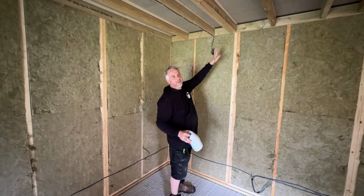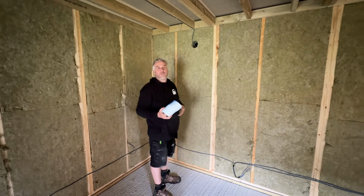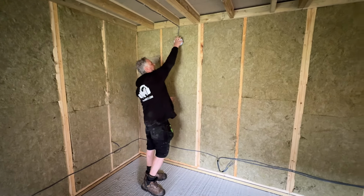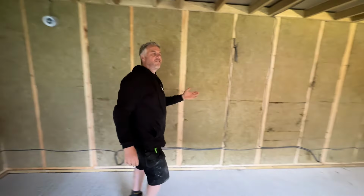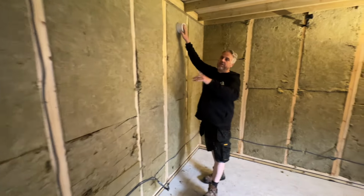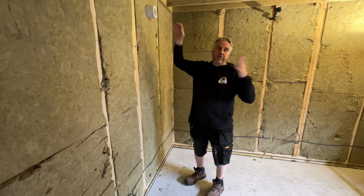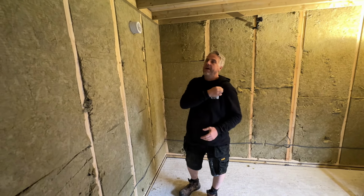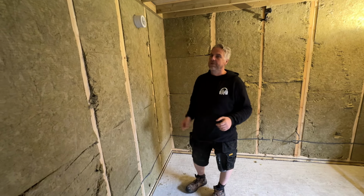So the idea is that through this vent, we'll suck air out of the room using the fan. And then on the other side, we'll have air naturally coming in through this vent as it gets sucked out. So for this to work, the door's got to be shut, so it's like an airtight sort of unit. And then obviously you can get airflow between these 2 vents.